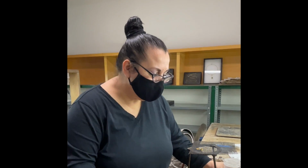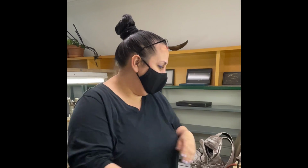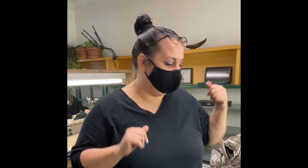And this is the same thing for people who work in 14 karat or white gold. They're doing the same thing because any kind of colored alloy, when you get that further enrichment at the surface, it makes the color not what you want it to be. So this is just a normal procedure for any kind of colored alloy. And 14 isn't a colored alloy, but it's got so much other metal in it that if you just work with it bare and then pickle it, the color is not good, and you have to sand off the surface. Okay. So at any rate.